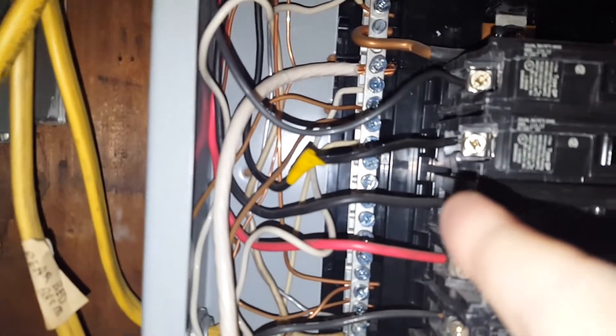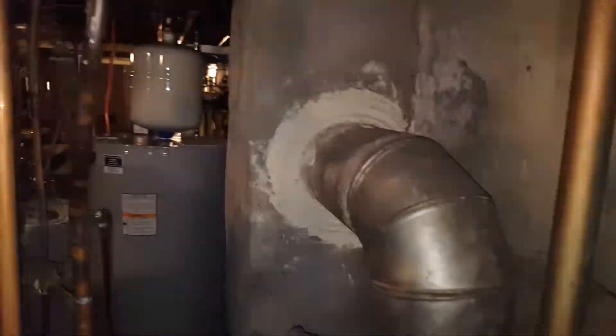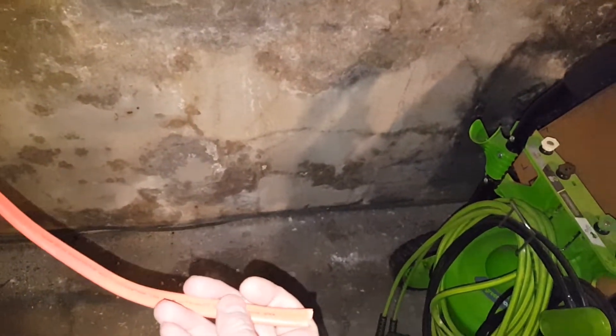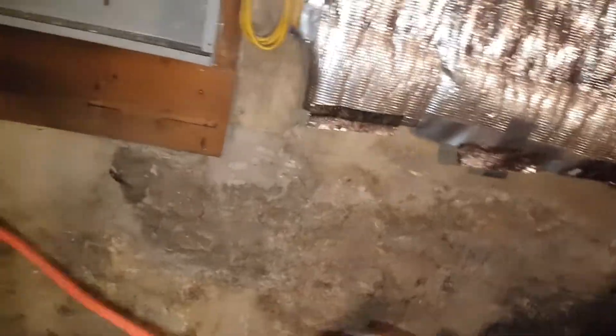I'm going to find a loose one — the one that doesn't have a wire in it — and put that ground in there, tighten it down, sticks out about an eighth of an inch. Make sure you give it a tug. That way I know my water heater is grounded. Both of these will say white and black but in my situation they're both hot. I'm going to put black tape around the white so anybody working on it knows it's not a neutral — that it's actually hot — because this is a 240 volt appliance with no neutral.